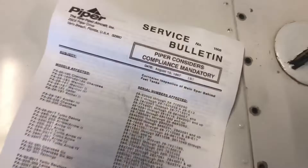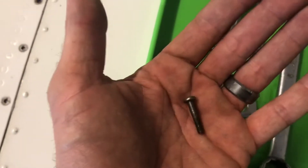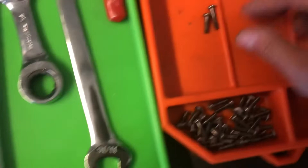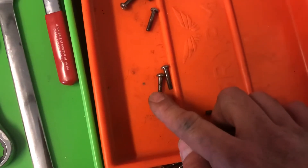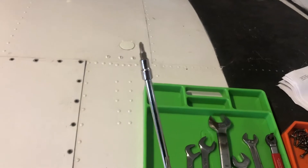To complete the 1006 service bulletin you need a basic set of tools. If the tank has never been out and had replacement structural screws put in, it may be a bear to do that job. You've got to start by taking out all of the screws around the tank top and bottom — there's a bunch. I urge you to use a speed handle versus just a drill. If you strip these screws out, it turns your day into a very, very long day.